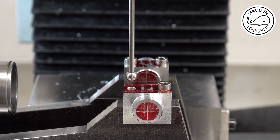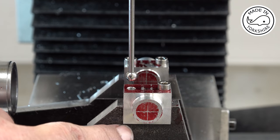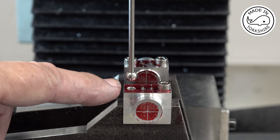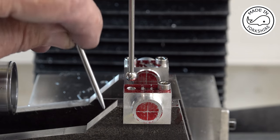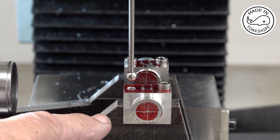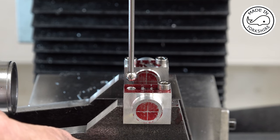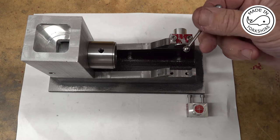Okay, so I'm going to do a bit of an experiment here. I've already drilled and tapped this side and bolted the bearing block down. And to find the centre of that hole here, I'm just going to try and use this thing on the wiggler. Previously, I've only ever used that on the wiggler to find the centre of a particular point. I'm just wondering whether that can be used on a hole. If I turn it on, now if it was out of centre, it would wobble all over the place, so I'm pretty sure I'm on centre there. So what I'll do is I'll take the part off and I'll centre drill and tap and see whether it's worked. Well, that wiggler attachment worked pretty well, and no doubt people will correct me if I used it in the wrong way.